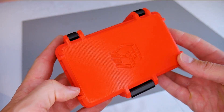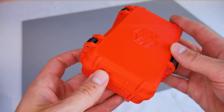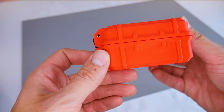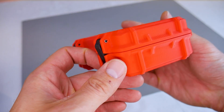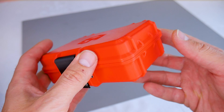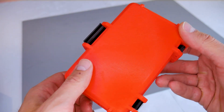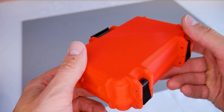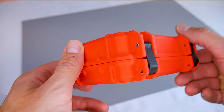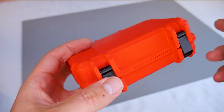In this next part I used both the red and black PLA to produce one of these snap latch cases. In the area with my logo there was some bridging that didn't come out particularly great — this was printed with a 0.6mm nozzle and I don't think I had my cooling settings right for bridging. Otherwise all the walls came out super clean and the 0.6mm nozzle saved a lot of time printing this entire assembly. If you're looking for a very vibrant shade of red then I would consider this brand; if you're looking for something deeper then look elsewhere. The steep overhangs were also pretty challenging with 0.4mm layer heights on the 0.6mm nozzle while still dialing in part cooling settings.